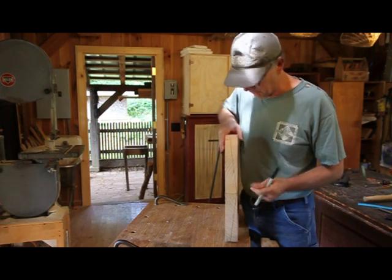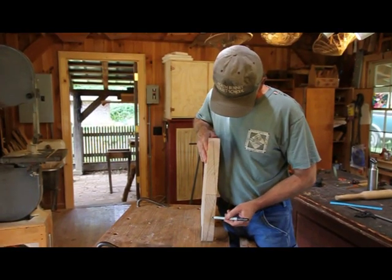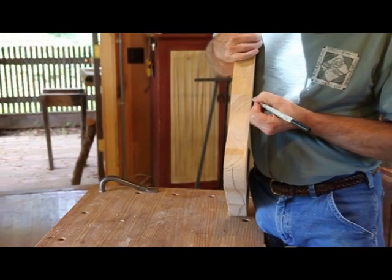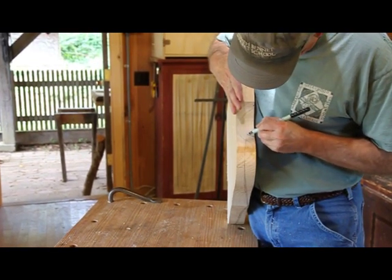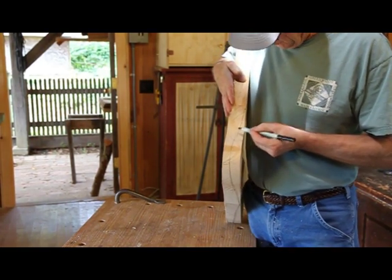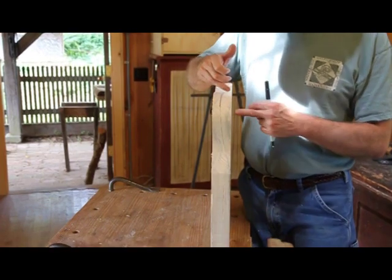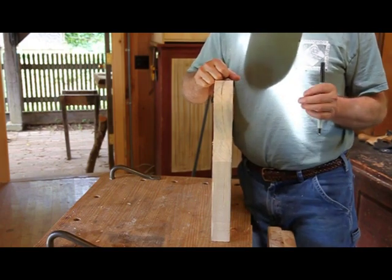Now I'm going to put a mark about right there, about an eighth below, and using the straight line as a reference, I'll make a sweep to come around right like that. I'll have to raise it up so you won't be able to see it, but then I'll show it to you. So now I've got these two not-so-well-defined crooked lines here that I've free-handed. My draw knife is straightening all that out and I'm going to cut down. Then we come over here to this side — there's the front of the gutter right there — and I'll just draw a little sweep with a slight curve. So I've got the left side drawn now, both sides. Then I'm going to start cutting into it with a draw knife, but before I do that, I want to take you back to the topographic map showing the contours of the seat and show you what I'm going to go after.